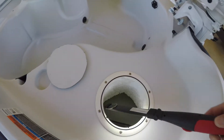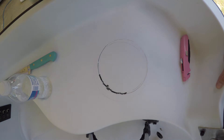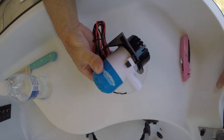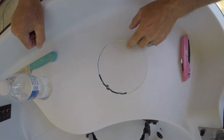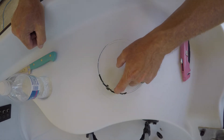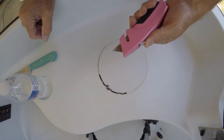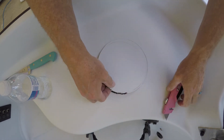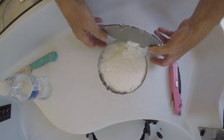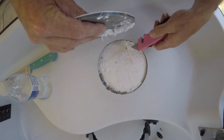I want to use my live well when we go fishing, so I've got to get it fixed. Since I wasn't able to stop the live well leaking on my Predator 103, I figured I'd show you — I bought a bilge pump. This is the bilge pump I'm going to try to mount into it. I've already cut the hole out; I just hadn't pried it off. I tried to use a little die grinder, but the hole was too rough, so I used a jigsaw blade to get it off. This is what it looks like inside, if you've never seen what one looks like inside.